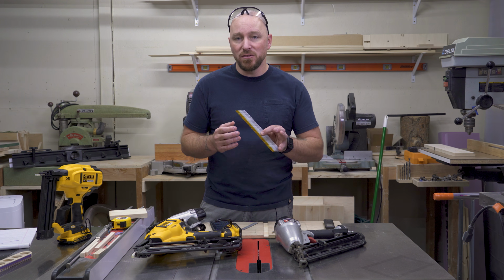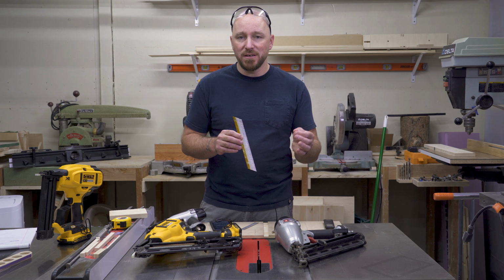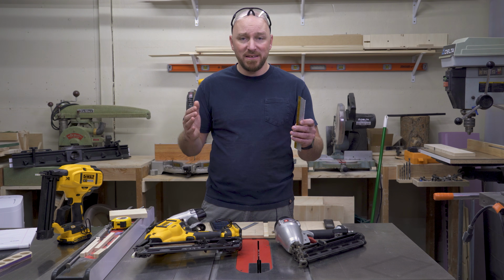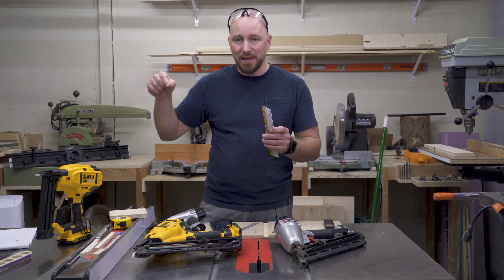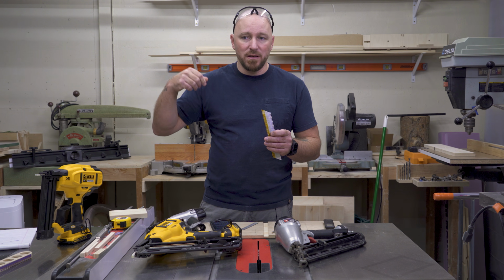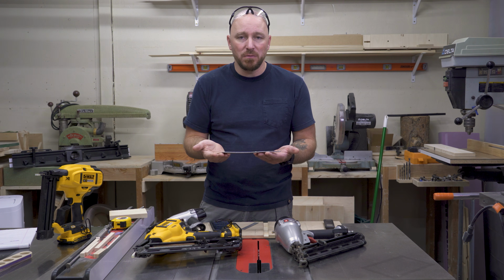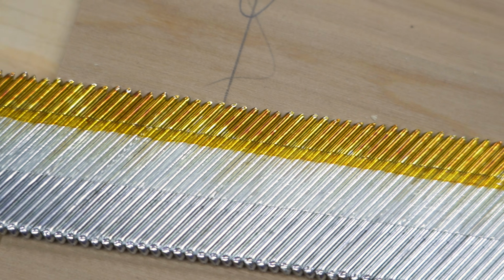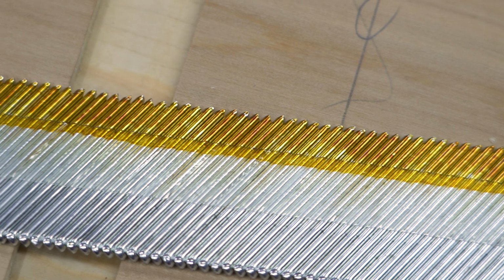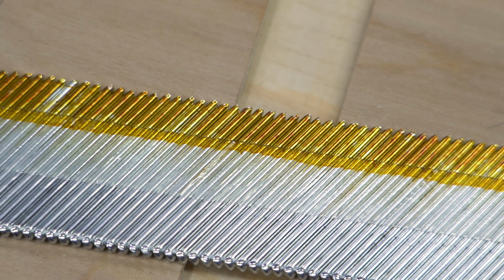This is going to make it so that things aren't going to rust nearly as easily when we use them on exterior applications. So if you've ever seen a fence and it has a whole bunch of lines coming down it, wherever they put a nail or a screw, those are rust trails. The screw or the nail goes into the board. There's no coating on it to protect it from weather. The nail rusts and it leaves a rust trail. So this electro galvanized is going to give us a little bit better protection against that in exterior applications.